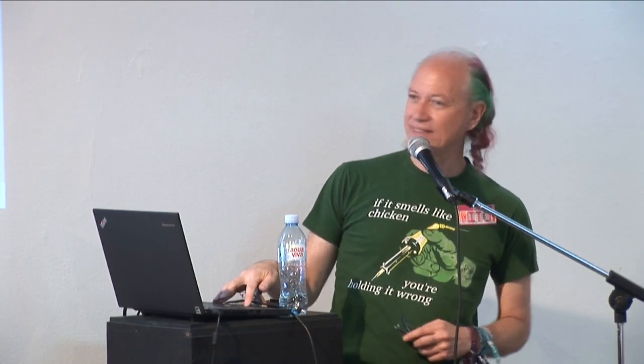A comment in Wiring, which is what this is called, but it's really C++, but they call it Wiring, starts in one of two ways: either with /*, and then it goes on and on and on until it sees */. Everything in between those is comments. And the comments here tell you the name of the program and what the program does.